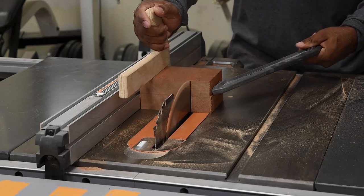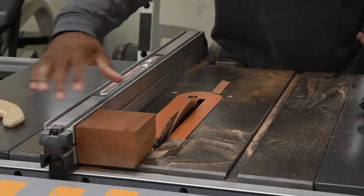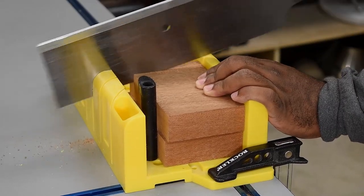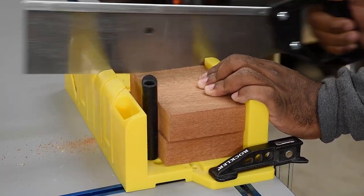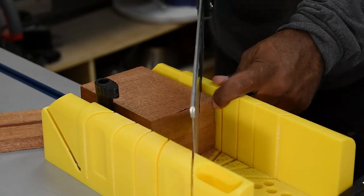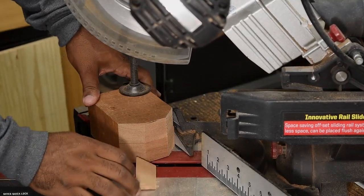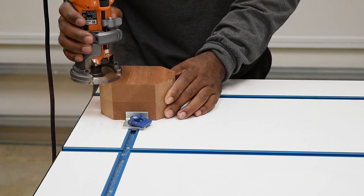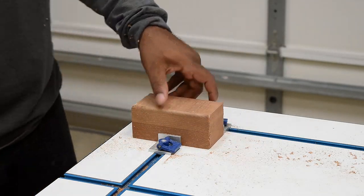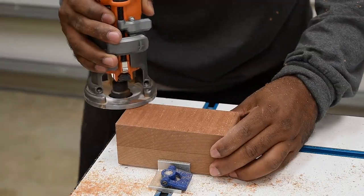With another design, I started with a square, then set the blade to a 15-degree angle to taper off the bottom. Some of these projects are doable with a hand saw, but a table saw or miter saw makes them much easier — if making a batch with a hand saw, get ready for a workout. You can also use a miter box to cut angles for more interest. I'm using a router with a round-over bit to create a soft edge going around the top and bottom. If you don't have a router, a sander can round over the edge slightly to give it a soft touch.